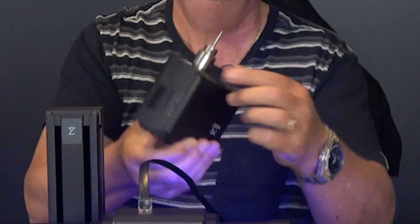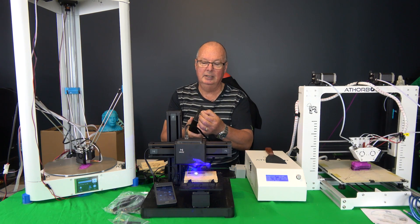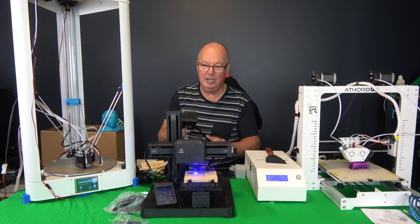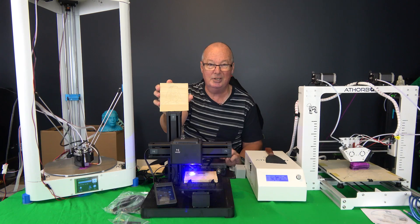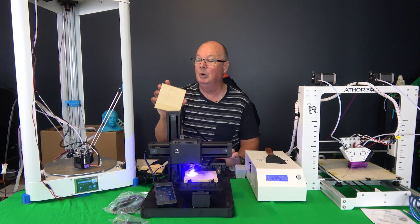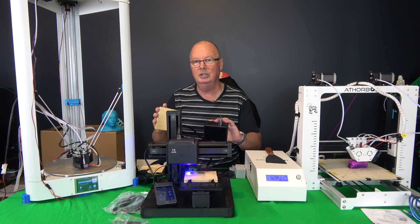It's also a CNC — a CNC head with a little chuck. One of the problems I'll mention later is that I had to use a bit from my Dremel to get it working. I did an engraving which is a little hard to see, but you'll see a photo of it. The engraving procedure is quite slow and noisy and messy, as they all are, but it still worked really well. It handled the shading nicely — really well, considering I was using a burr bit and not a CNC detail bit.